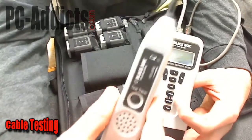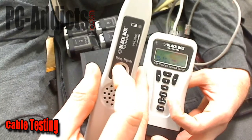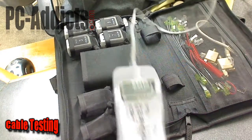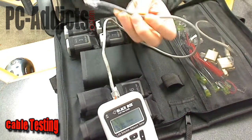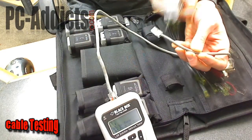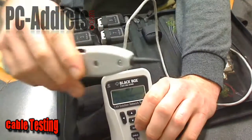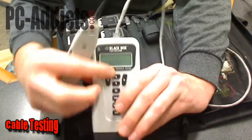What I'm going to do with this probe is walk downstairs and try to find where that cable is. You hold this button down — you can hear that tone. This is still generating a tone until I tell it to stop. So pretend this is the end of the cable in the patch panel area — press this, let me get it by the microphone.